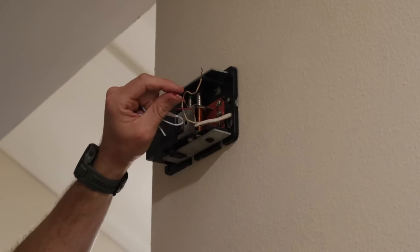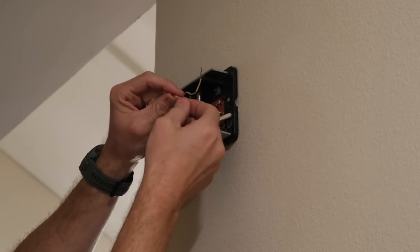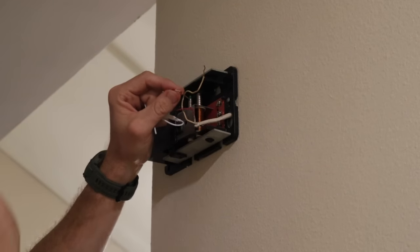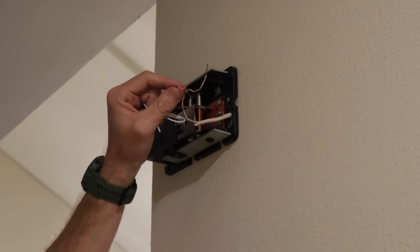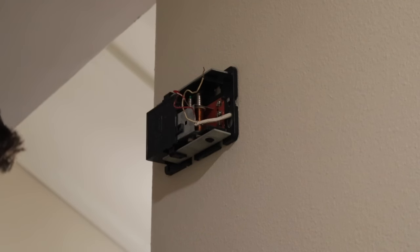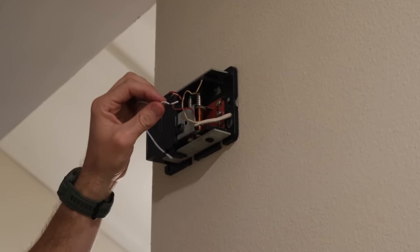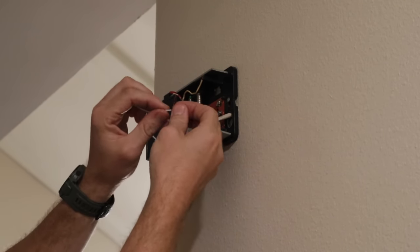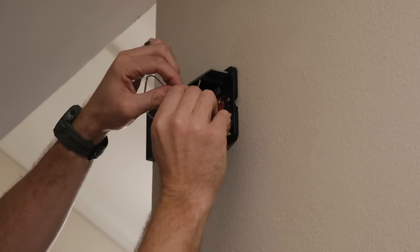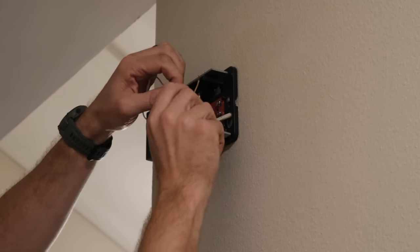If these little bits of copper are so long that they'll hang out from the wire nut, you're going to want to trim those a little bit. Copper is a pretty soft metal, so if you don't have regular cutters, you can probably cut those with a pair of scissors. You do want to make sure they don't hang out, because you don't want them to ground on things. Then to connect them, you're going to pull that little piece of insulation off the end of the wire, hold the wires next to each other and twist them around each other.